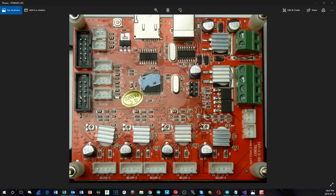We also do have the connector for an LCD though. Again, it's designed to use the standard RepRapDiscount full graphic smart controller, which all the other ones have used as well. Difference is this one has the pins configured correctly, as in these connectors are put on the right way around, so pin 1s do align. Therefore the standard display controller will work right off the bat.